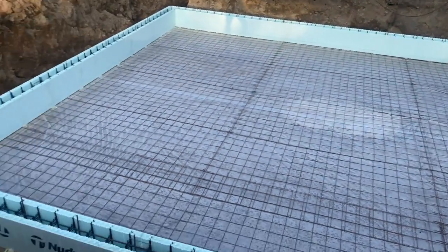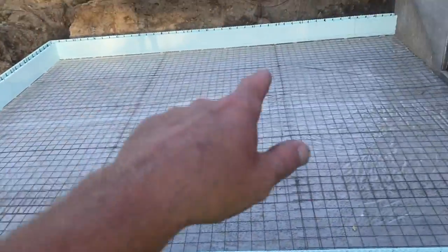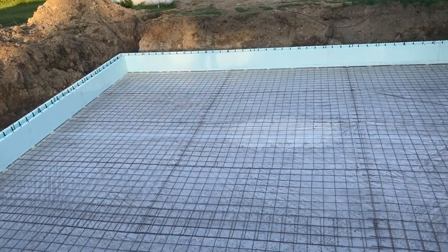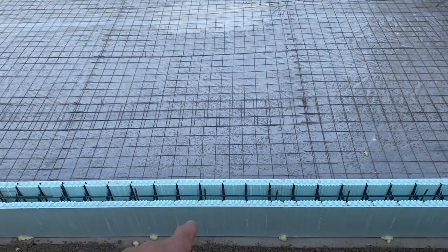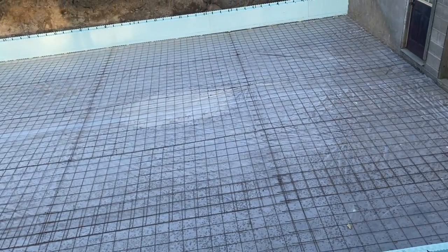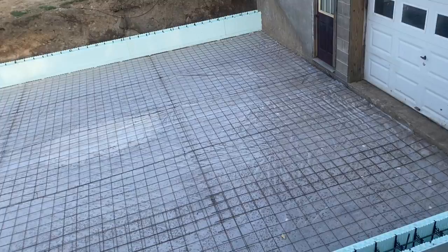The reason we're pouring the floor before we build the walls is it's a lot easier. We can bring a little conveyor truck right in here and just shoot right in there and fill it easy. When we finish this floor, I'll show you how easy it is to do the edges. You can reach right over there from the wall and just mag your edges. You don't have to get on knee boards or nothing.